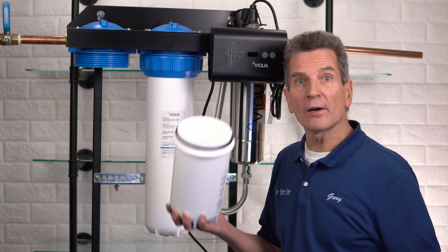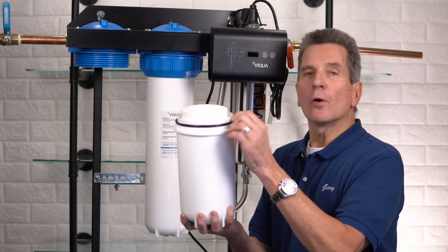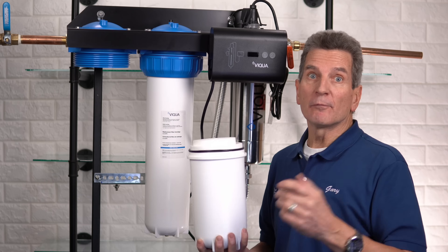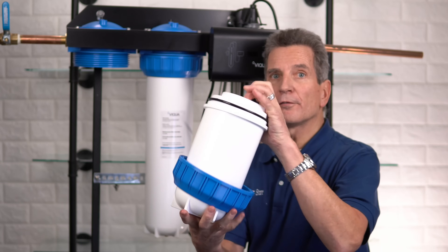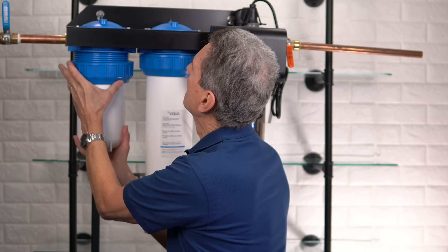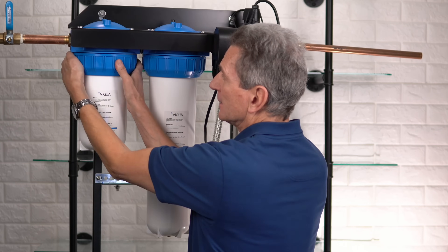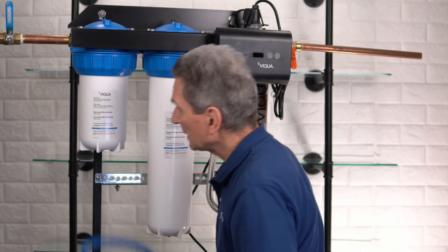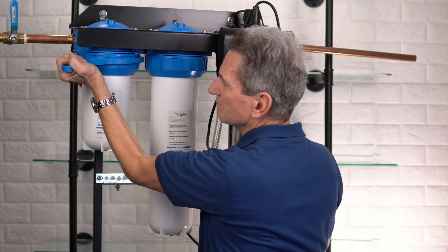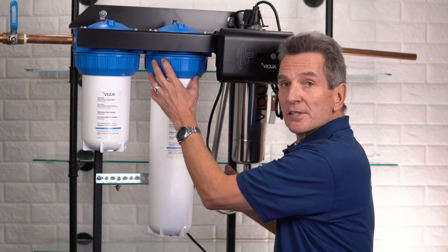Using your bucket of warm soapy water, wash out the inside of the housings. Put the new filter back inside. For the O-ring around the housing, I definitely suggest using Plumber's Clear silicone grease — I'll put a link in the description. Then take the collar and place it back over the filter housing, pull it all the way up, slide it in, and tighten it up. First do it hand tight, then using the filter housing wrench give it just a little bit more — usually no more than a sixteenth of a turn — just enough to make sure it doesn't leak. Then do the same process for the carbon filter.